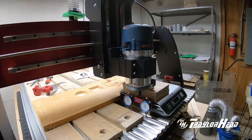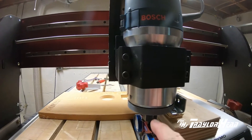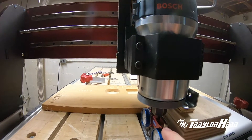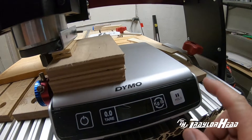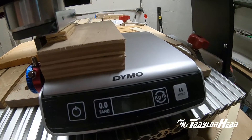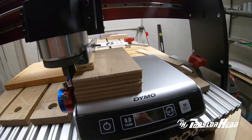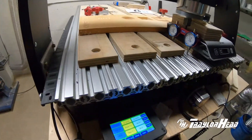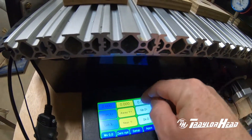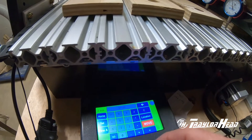Everything's in tram so we're good on that. We've zeroed out our dial indicator and got everything shimmed up to where it's barely touching it. If I move a thousandth of an inch I do get a weight variance on the scale and my dial indicator moves, so I know I'm right there at it. We'll move it down one tenth of an inch and look at the weight and the variance on the cage.